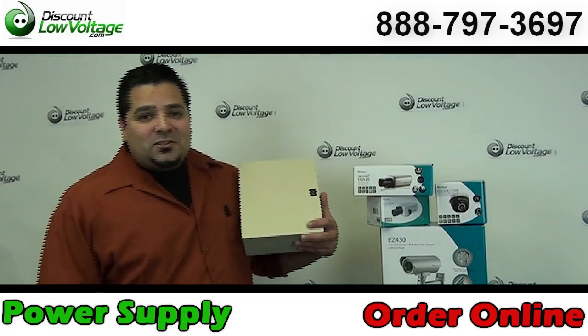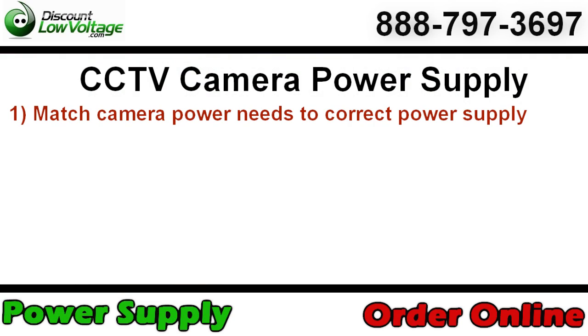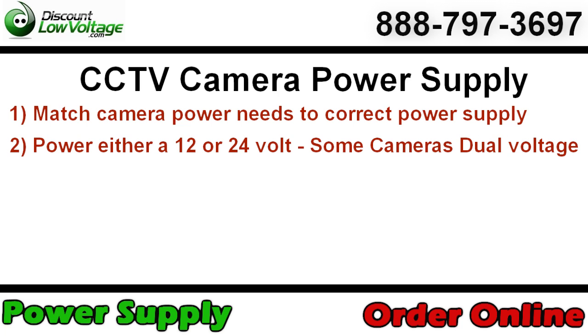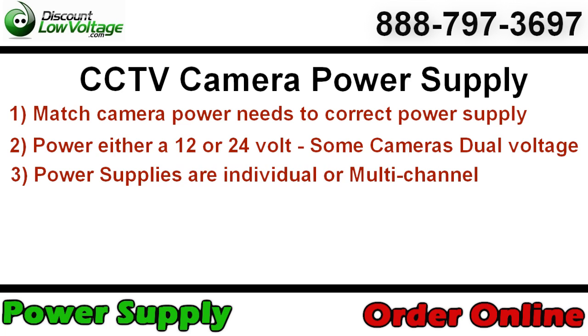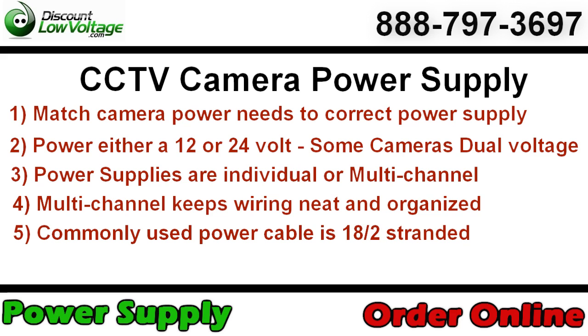Okay, so let's go over what we just went over. Match the camera power needs to the correct power supply. Power is either 12 or 24 volt. Keep in mind some cameras are dual voltage. Power supplies are individual per camera or multi-channel for multiple cameras. Multi-channel helps keep the wiring and installation neat and organized. Power cable used is an 18 gauge 2-conductor. Power signal is around 1,000 feet.